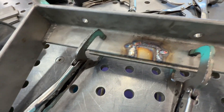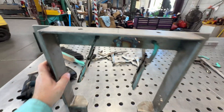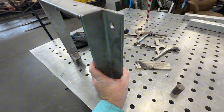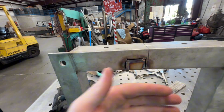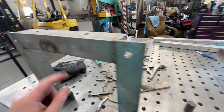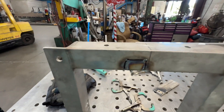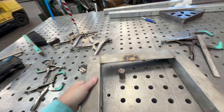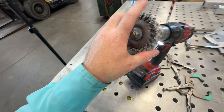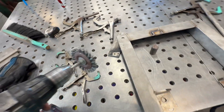That side is welded. I noticed when I was welding it was opening up a little on a grind mark, so I just went over that really fast — no big deal. The aluminum plate will be really hot. It's still coloring on the back side but it prevents any burn through or sugaring. Copper and brass are better to use but aluminum is the next best thing. I should wire brush this before I weld the second side — here's my little stainless steel wheel on a drill.